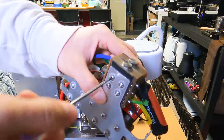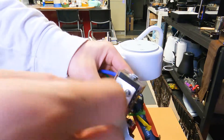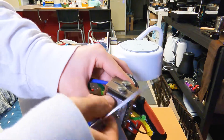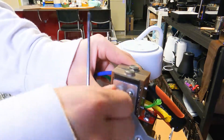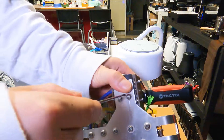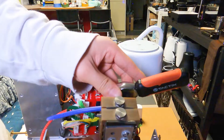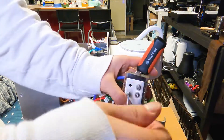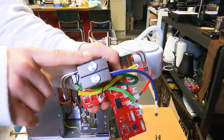The bolts are old ones, so you need a T10 Torx screwdriver or a T10-size hex driver. Hold it and unscrew. Note that newer manifolds don't have separate nuts — they're on the plate, making the job easier, and they just have two bolts.